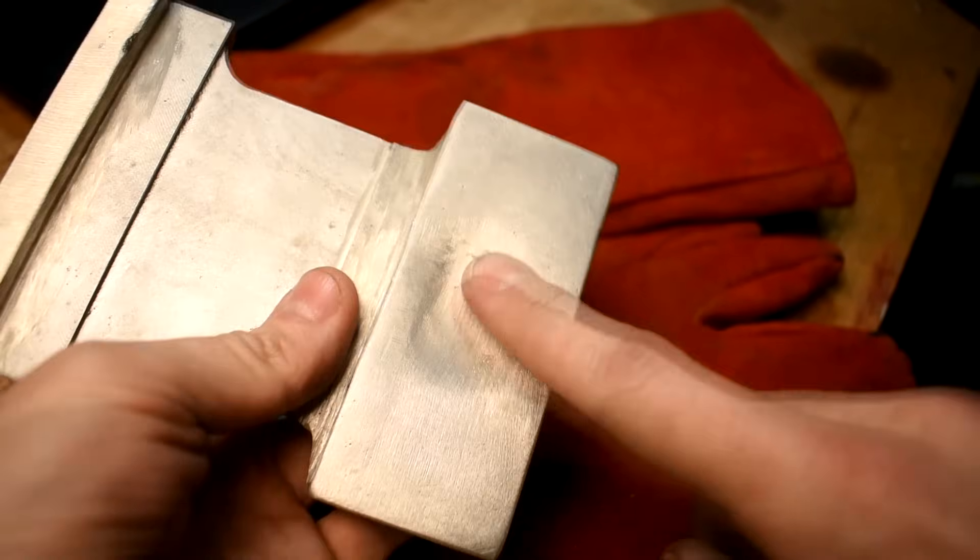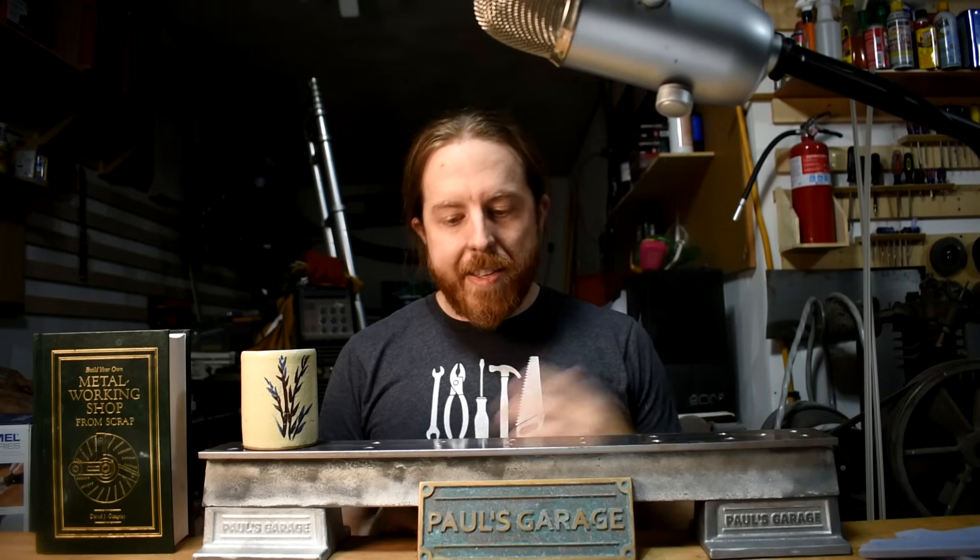It's not caused by being too cold outside, although temperature is a factor. Shrinkage happens when metal cools. Especially when it solidifies, it wants to contract, but the whole thing doesn't solidify at exactly the same time. The very last part to solidify usually feeds its metal to the rest of it and ends up all shrunken, sad, and deflated looking. Different metals are better or worse for this. The metal I'm using is not the best, not the worst for shrinkage.